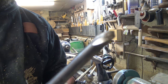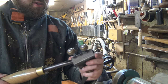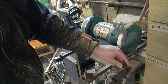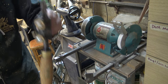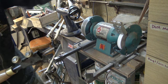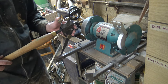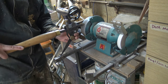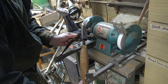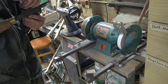The tool has taken a bit of a battering with all the unbalanced turning, so it's a little bit blunt. I'm going to use one of my homemade sharpening jigs to sharpen it up. I set the bowl gouge to a two-inch gap — nice and solid — and I've got a little gauge I set to the correct size each time. There's a little hole the jig slots into, and I can then do my Celtic grind. You can see a consistent bevel throughout with a razor cutting edge on top, so that should be good for cutting the other side.